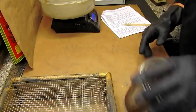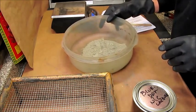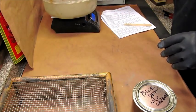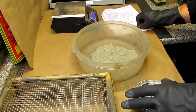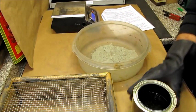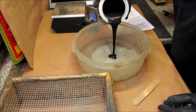I've got my furniture stripping gloves on, the NC lacquer I made the other day, my batch of crackle mix, and I've weighed this batch on a scale. Scale's reading is zero. So I'll be able to know how much of the NC lacquer I have to add to get the wet putty consistency that Lloyd talks about.